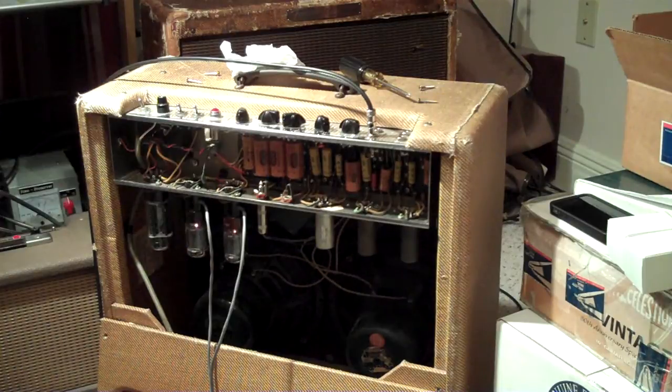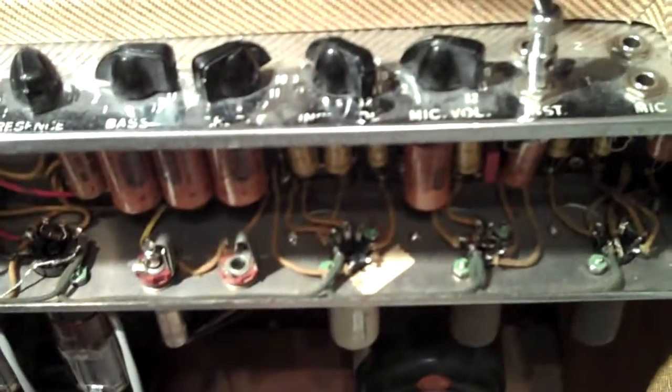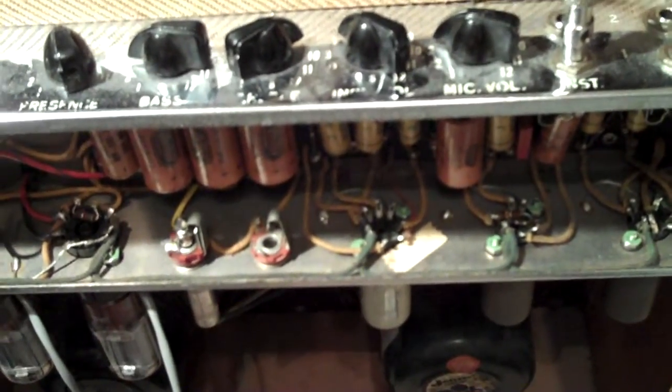My good old amp still has Loopy's tape in there — those are always amazing. That's the Scotch tape that Loopy put in there in 1959, which probably adds about two thousand dollars to the amp's value because most don't have that. Loopy is pretty famous at Fender. You can see the bias probes are plugged in now that I've got everything dialed in with the meter and tube tester.